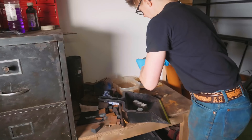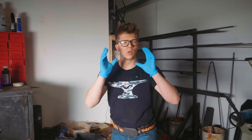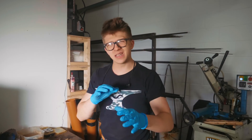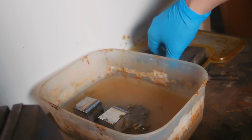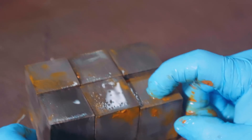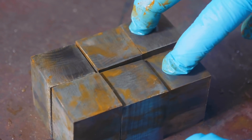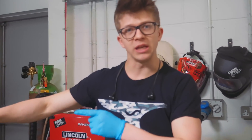What we're going to do instead is a six-way stack. Of course, we're going to go into the ferric chloride for a test etch on all the ends so that we can look at the pattern and organize it how we want. All I've done is taken that billet — where we had pattern coming upright and pattern coming from the sides — and forged it down. We're then going to organize it and create an interesting pattern. This is what the pattern looks like right now on all of them. I'll transfer them over to the bicarbonate of soda to neutralize the acid. Now we're going to try and find the most interesting way to arrange the pattern in this formation. It's now time to tack weld it all together, put a handle on it, back in the forge, forge weld it, and start getting it ready for the next stack.